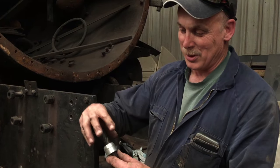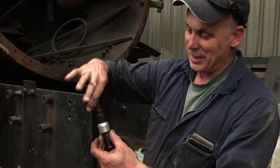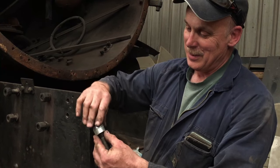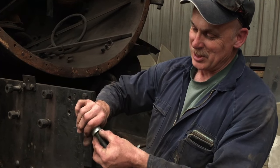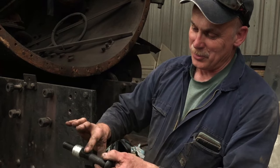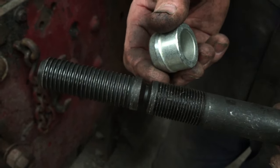The tool comes along and pushes the sleeve tight while gripping that part of the shank. It gets to a point where the sleeve can't move any further forward, so the sleeve is actually compressed onto these rings here. And this neck is where it breaks when you pull it up tight.